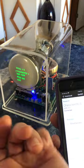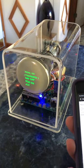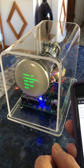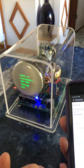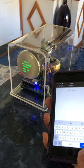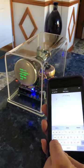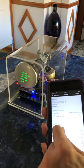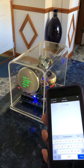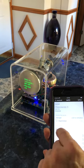Now it's on the time zone. You can select the frequency and time zone appropriate for your area. DST is daylight savings time — you can turn that on or off if necessary. It's automatic, but you can adjust it. 'Turn Wi-Fi 1' means it's currently set up to extract time and date from the network. To change that to the GPS module, type capital S until you select that line, then use capital C to change the option on that line, as it does on all lines.